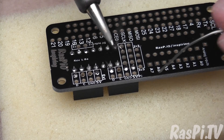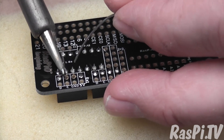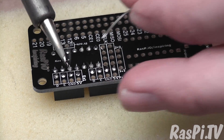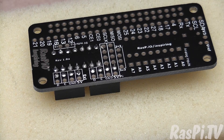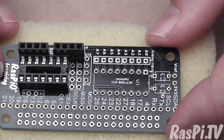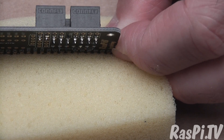Those are the ground ones — you can see what they are — that was 5 volts, ground, clock and data. The ground pins might need a bit more heat because they're connected to the ground plane of the board. I've got my soldering iron set at 350 so it's not having any difficulties with these even on the ground pins. Close-up: they all look good, and flipping the board over it looks pretty straight and pretty good. I'm happy with that.